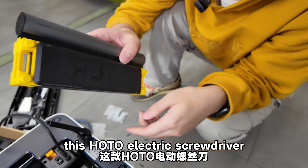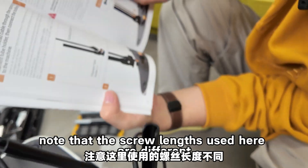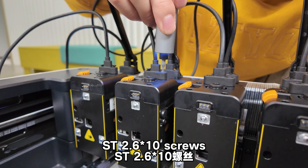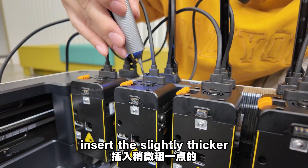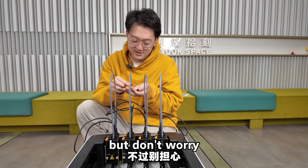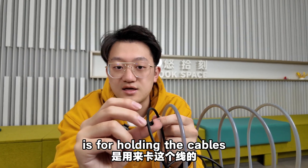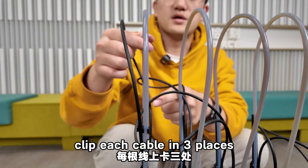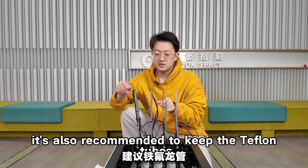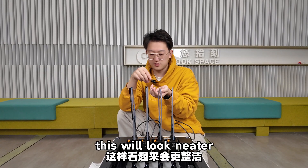There are quite a few screws to tighten here, so let's bring out the HOTO electric screwdriver to speed up installation. Note that the screw lengths used here are different — one end plugs into the two-heads but the fixing screws on this end need to be shorter: ST2.6×10 screws. Insert the slightly thicker 6mm guide tube into the two-heads. The cables look a bit messy, but just clip this cable comb on — the side with grooves holds the cables, the smooth side holds the PTFE tube. Clip each cable in three places and keep all black tubes on one side for a neat result.